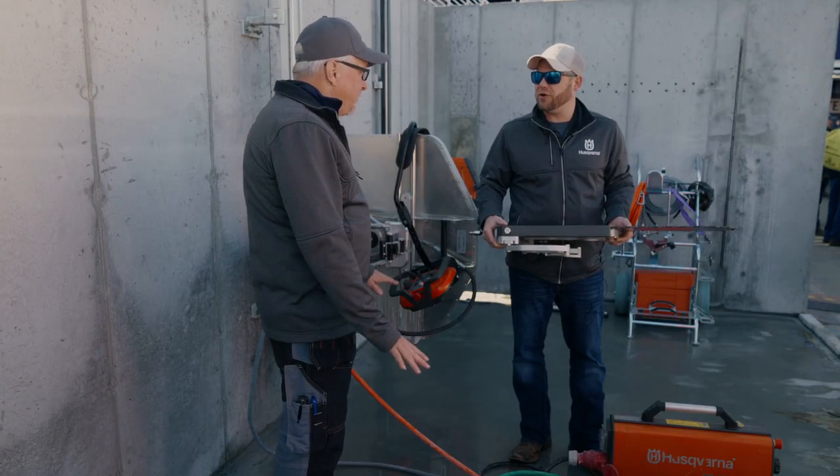And what's the benefit of using the WSC40? Just to take the man power up — you know, guy getting tired at the end of the day — it's very accurate. It's also able to cut flush, which is a really big advantage. So bottom of door openings, corners on window and door openings. Exactly, any place where you've got any obstruction getting close to the edge.